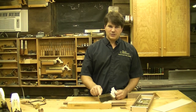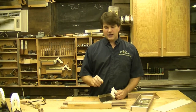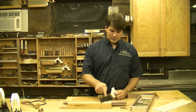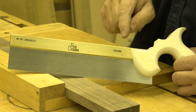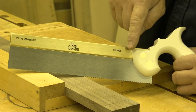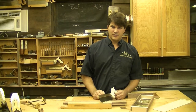We use 15 teeth per inch, extremely sharp, and a very narrow two-thousandths of an inch set per side. It leaves a beautifully thin kerf. We fasten the blade to the brass using four copper pins — very secure — and the handle to the saw itself using split nuts. The top split nut not only goes through the handle but through the brass and the blade as well, making for a very secure method of construction.